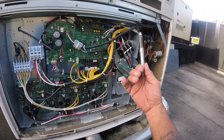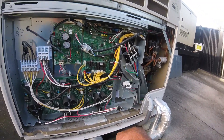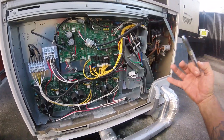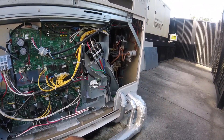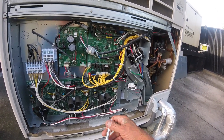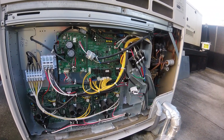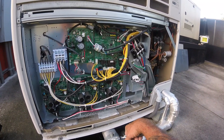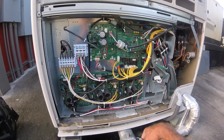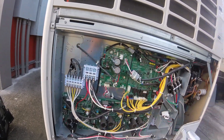Each compressor is about 33.3% capacity. So today I'm here to replace the compressor - it'll be a little fun. I gotta figure out how to get this whole cabinet out of my way. It holds like 53 pounds of refrigerant. They've been complaining this summer - barely running at 66-67% capacity. I think it's a six-ton unit.